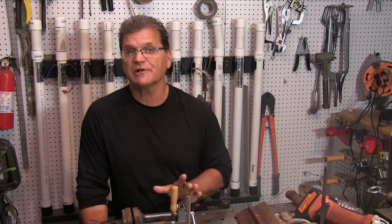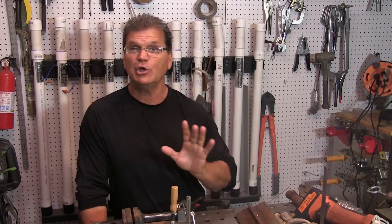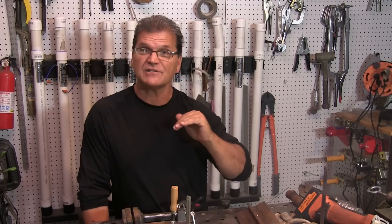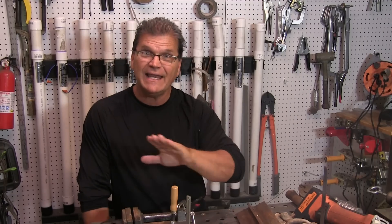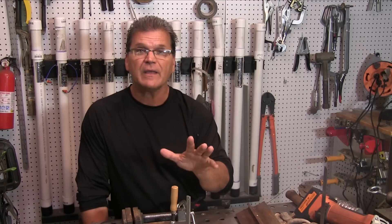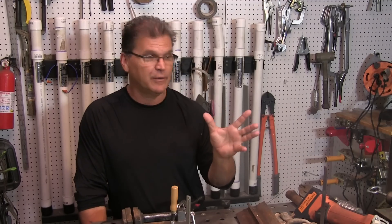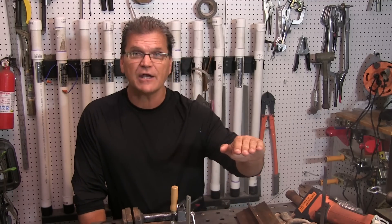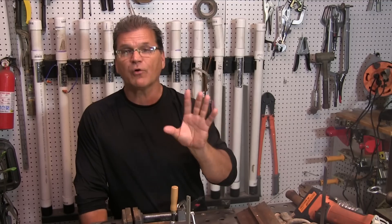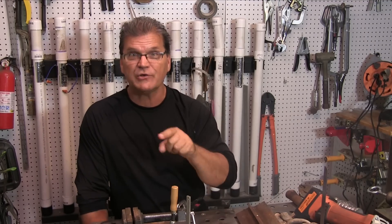Hey, Jody here. Today I'm doing a little work with silicon bronze. This is a part two video of that cube. I'm trying to make the cube look cool now. Now that I've got a single TIG pass in there with weld metal, I want to buff it all down with a wire wheel so it's shiny, bright metal. That's important when you're using silicon bronze — you want nice, clean, bright metal to flow it over. So I'm going to flow silicon bronze in those outside corners, then talk about some of the other uses of silicon bronze. Let's do it.